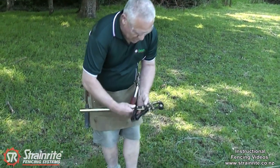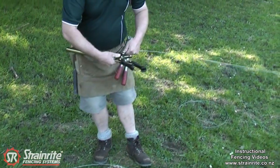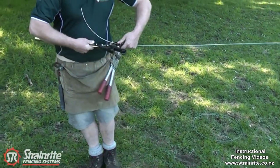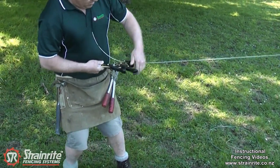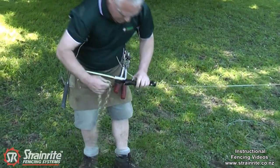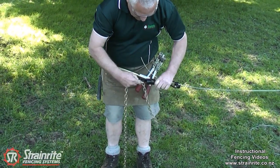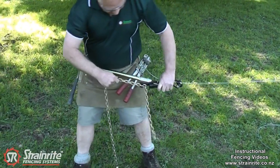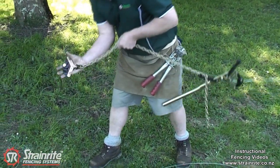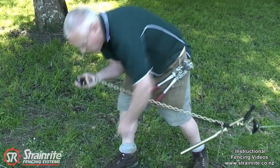Putting it on the wire, you put the handle end on first — about 300 past there. Pull it to embed the wire; it doesn't slip out. Then hook the chain into the claw. Run your handle on — you can drop the handle there, don't have to hang on to the handle end. Little finger and thumb behind, three fingers in front, holding it back like that.